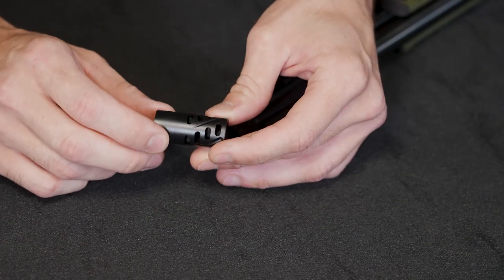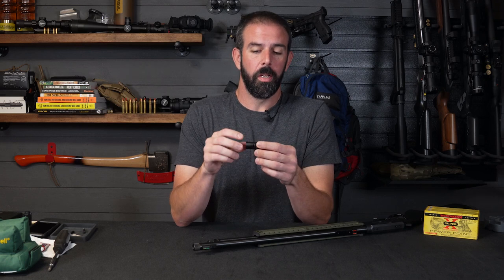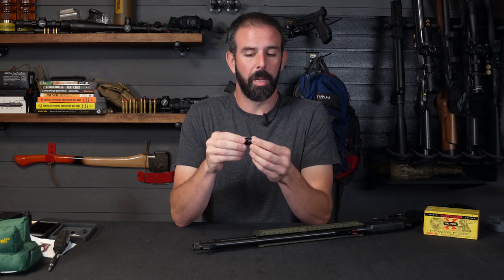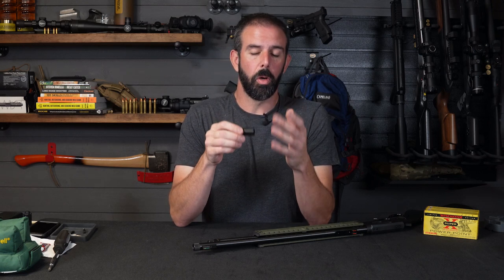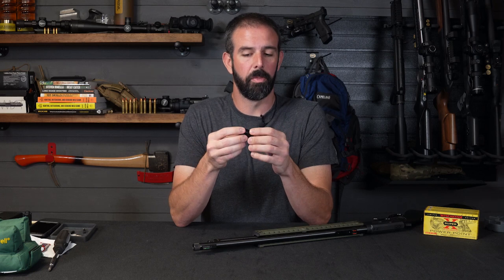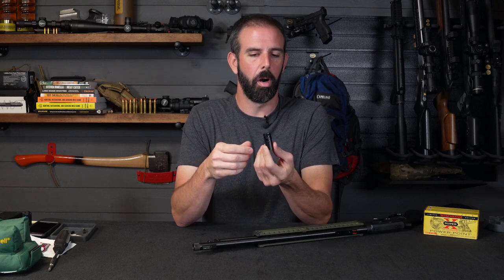These are extremely well machined, really nicely finished. One thing you'll notice right off the bat is they are completely round — there are no flats like you would have on a standard muzzle brake for a modern sporting rifle or bolt gun. This is kind of like a flash hider, but it's also a brake. It doesn't have those flats because you don't have to time it. It has openings all the way around, so you don't have to time it like you do a standard brake with your vertical and horizontal axes. You just put a few drops of Loctite on there and crank it down by hand. You don't want to crank it down so tight you can't get it back off, because when I want to put a suppressor on here, I want this to be fairly easy to come off — I can just pop a screwdriver in one of these slots. I've got some brass ones I can use; I'm not going to mar this thing up. That way it's very easy to get off when I need it off.